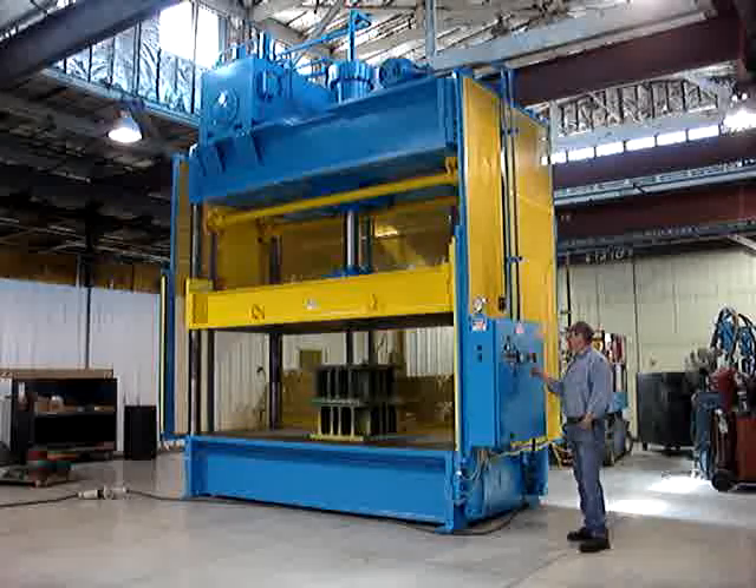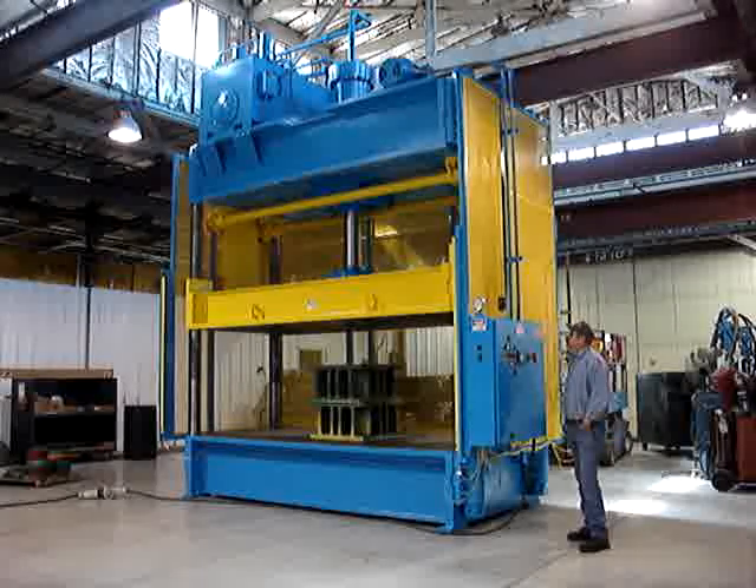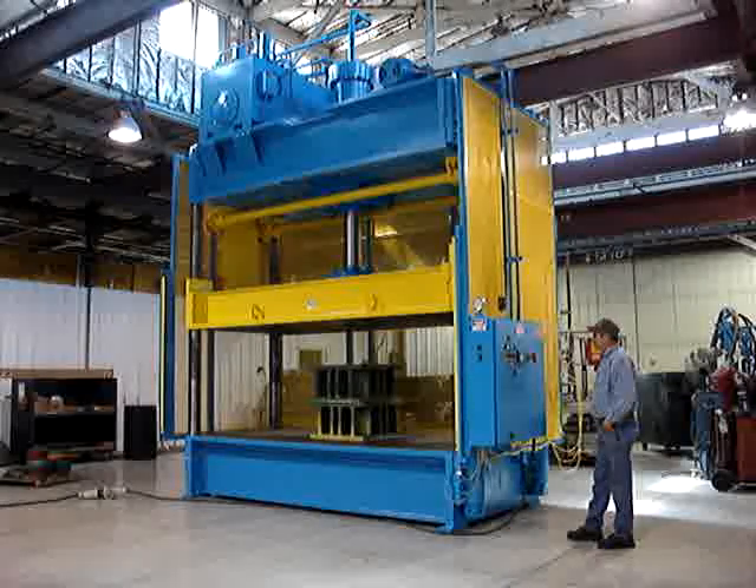This is job VE-0106, 200-ton four-post down-acting press. We're going to demonstrate the initial cycle in auto. I'll walk in and break the light curtains as the operator is pushing the palm buttons to show the press is protected. If the operator releases the palm buttons they will relatch, but they have to be pushed at the same time. The press also incorporates hard metal guarding on the other three sides, bolted on, and has an emergency stop button on the main panel. Once the press clamps up, the operator can release the buttons, and the press will go up to tonnage, then decompress after it times out, and open back up slow then fast.